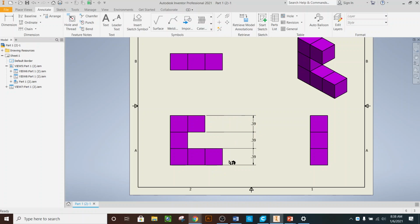And this one is used less frequently because if there's a mistake right here, like when you're manufacturing something, that mistake will get translated into this and then so on. So they're all connected. If you make one little mistake, it gets compounded every time you do a new measurement. That's kind of why the baseline tends to be a better one.